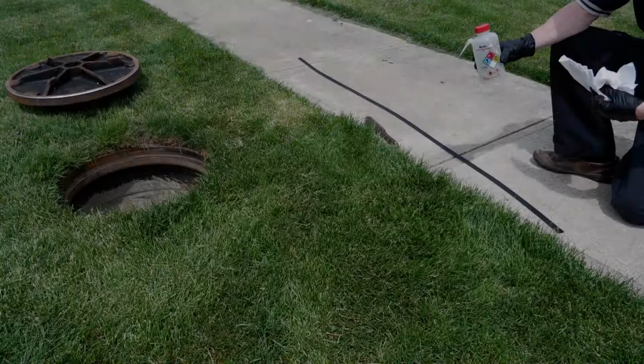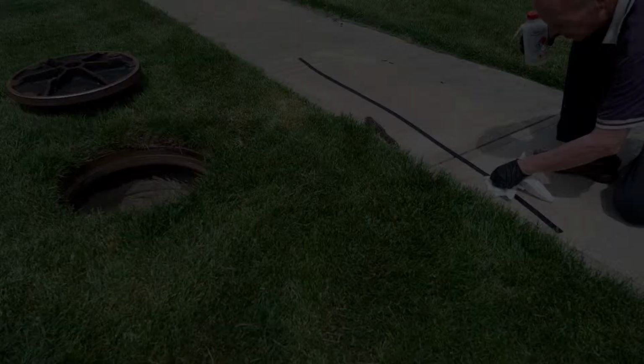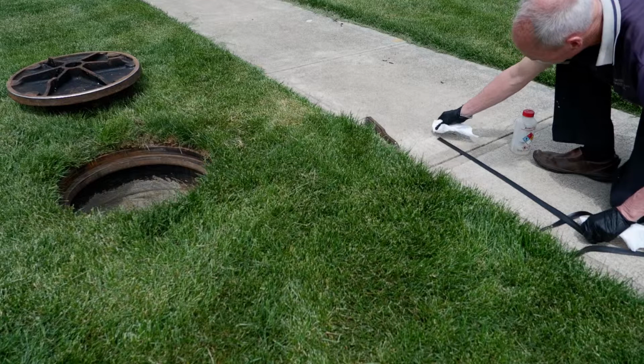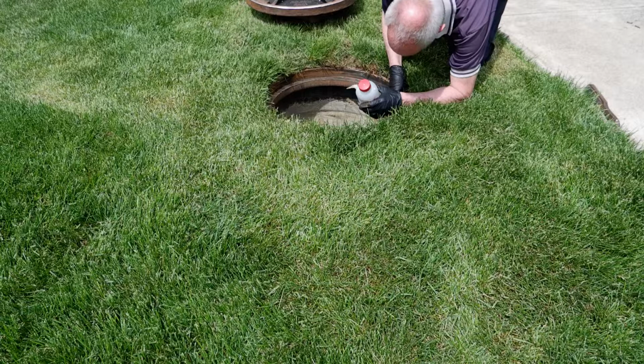Be sure to clean the backside of the rubber with a rag and acetone to ensure that the adhesive will bond with it. Also, clean the frame wall with a rag and acetone to ensure a good bond can be made with the adhesive and the metal frame.